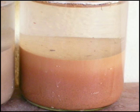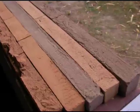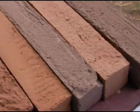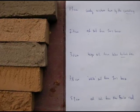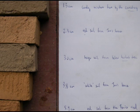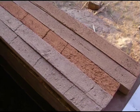Once you've found a suitable soil, you want to do a shrink mold test to determine the proportion of cement you need to add as a stabilizer to stabilize the clay. The top soil — the sandy one — shrunk 1.3 centimeters. The bottom, the red soil, shrunk 5.4 centimeters. And the middle, the beige one, shrunk about 3.1 centimeters.